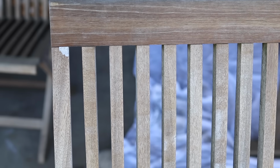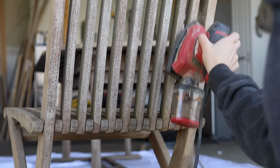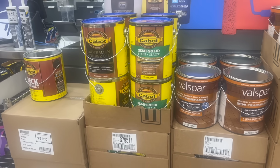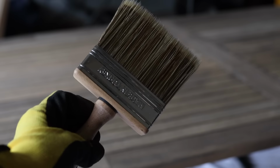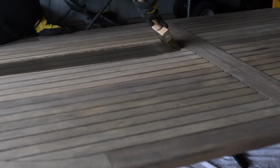The purpose of doing this is so that everything is nice and smooth and as even as it possibly can be before you apply your stain. With everything sanded down, it was time to choose a stain. Because my stamped concrete is on the gray side, I wanted something that was going to complement that tone. I ended up going with the color of the year for 2025 by Cabot. This is not sponsored in any way. It is called Burnt Hickory, and I chose to do it in a semi-solid finish so that it would still have some blocking ability for spots that were still uneven.